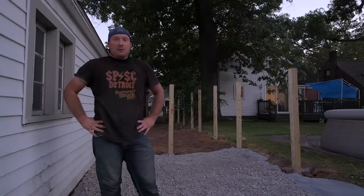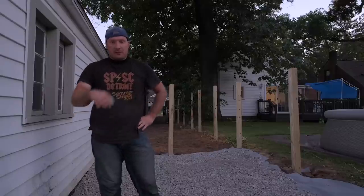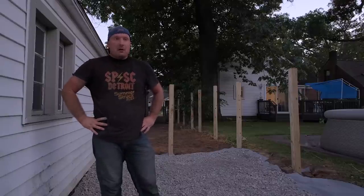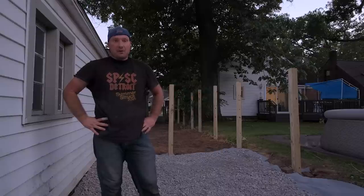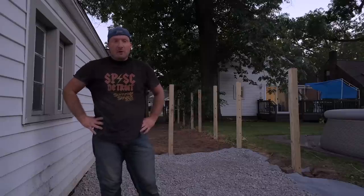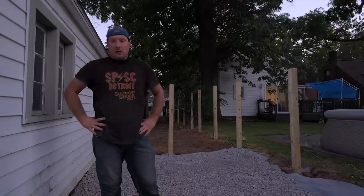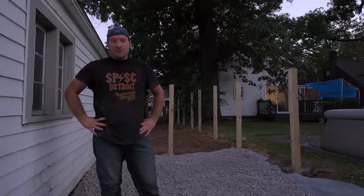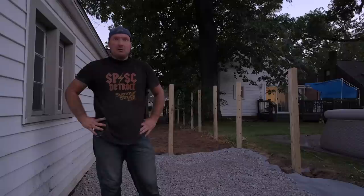So the front yard, we took out the sidewalk, demoed the concrete sidewalk going from the city sidewalk to the front door. Then we started to rototill up there, did a couple passes of the rototill and some leveling, filling in where the sidewalk was demoed and some other low spots, and we had some high spots, so some cut and fill up front. So we'll finish up the rest of the limestone tomorrow. Some rototilling, like I said.